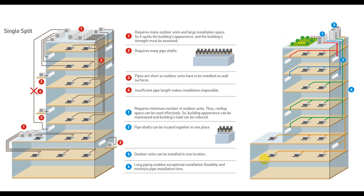Fourth, piping makes installation impossible for the single split in certain layouts — as shown, if you place the outdoor unit here, you cannot run the pipe far enough if the height exceeds the factory specification. But if you choose the VRF system, you can run the pipe as long as the specs allow, and it is guaranteed to be longer than what single split supports.